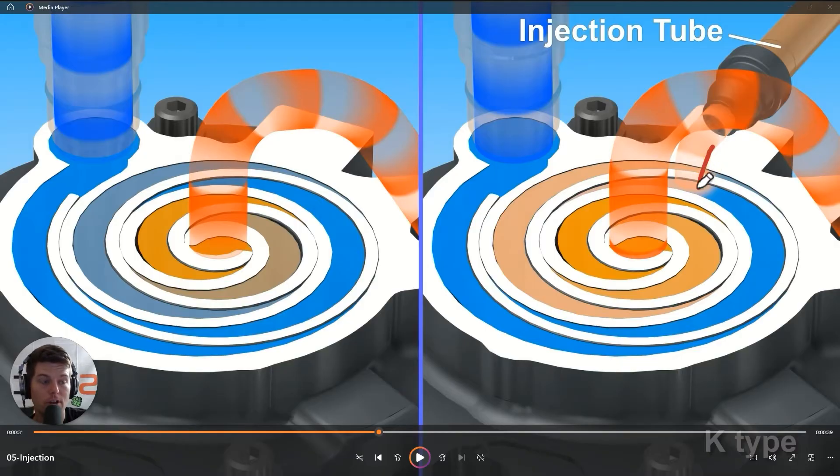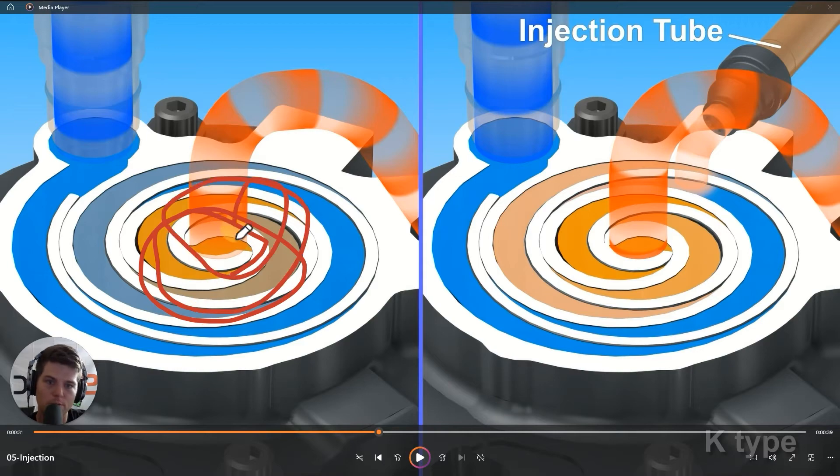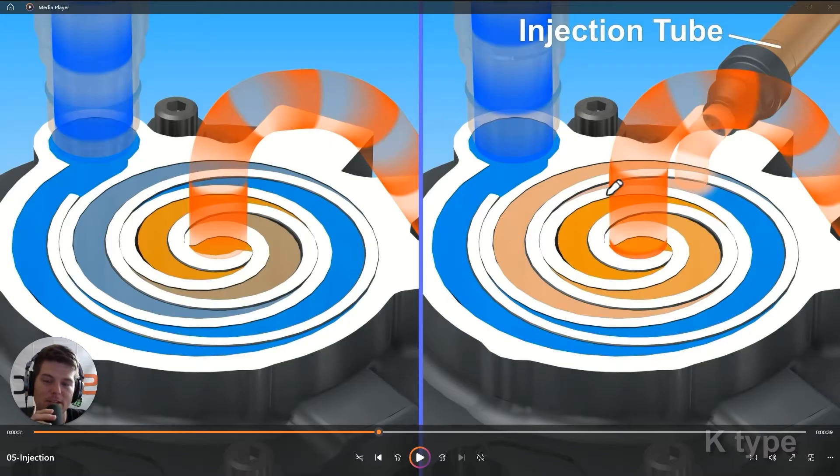To fix that, we add an injection tube on the right side. We take vapor at around 200-215 psi — based on the manufacturer — and dump it into the intermediate phase of the compression process. Instead of running 80 psi through the rest of the scroll set, we inject 200-215 psi into that low-pressure mid-compression zone, filling those cavities up with high-pressure vapor.